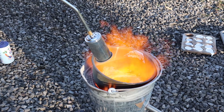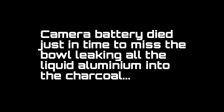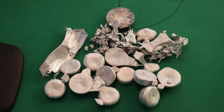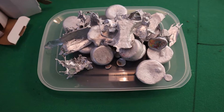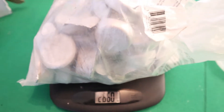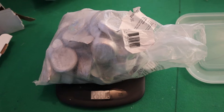So typically this is where my camera died and I didn't notice. The mesh had sagged and the bowl had become directly in contact with the charcoal. The intense heat punched a hole in the bowl and most of the aluminium leaked out. This rendered the remaining charcoal into a large, smelly paperweight. I managed to rescue a bit of aluminum but the day's output was disappointing. It turns out thin steel crucibles are pants.